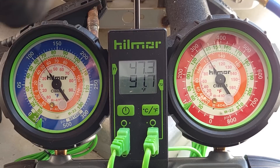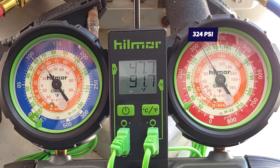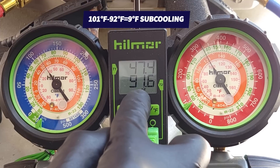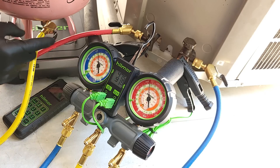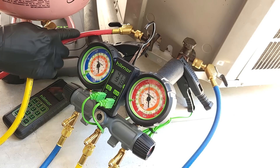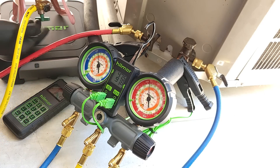It's been about two minutes and we're reading a pressure of about 324. We take 324 and bring it into the saturated temperature inner ring for R410A and we're looking at about 101 degrees. So 101 minus — we'll call this 92 — and we're left with 9 degrees of subcooling. We're just slightly low now, so we're going to shut our bottle off because we don't want to add any more refrigerant from the bottle, but we can add what's remaining in our hose right here. We're going to charge that liquid back into the system — we're very close to our target subcooling.